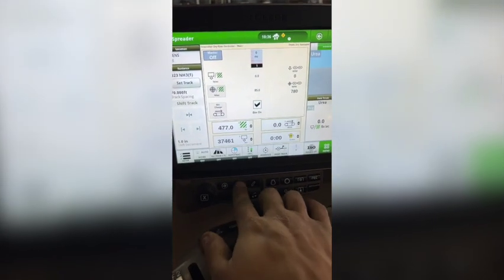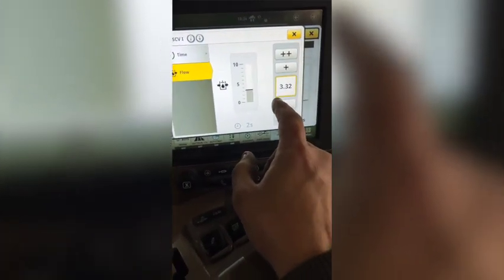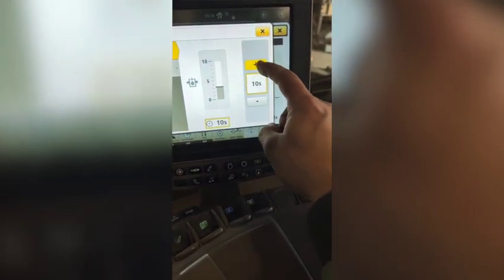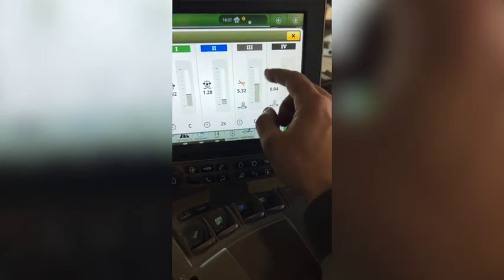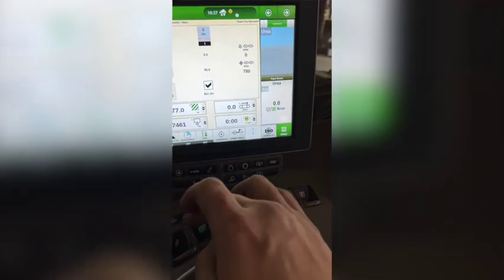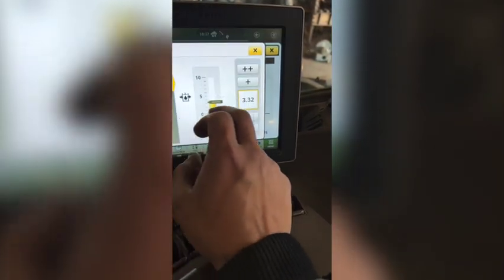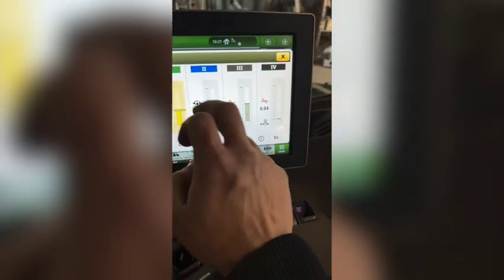So here's our screen. This is our hydraulics button. I usually keep that pretty low at first to make sure nothing's wrong, so I don't ruin nothing. And then I gotta go here and go to continuous, so the spinners spin the whole time. And then that tells me what they're supposed to run. So I'll click it on here. I run 350. Speed it up to 470.